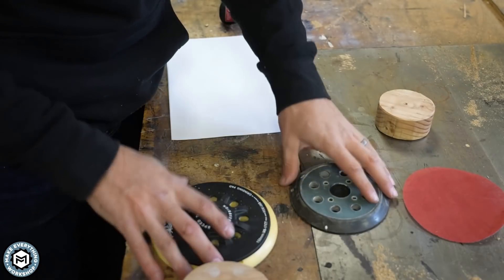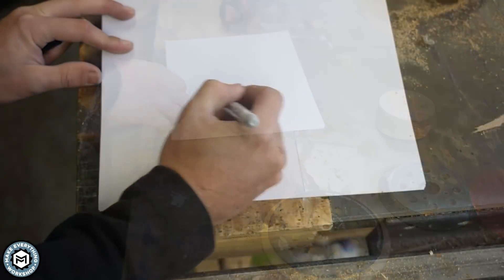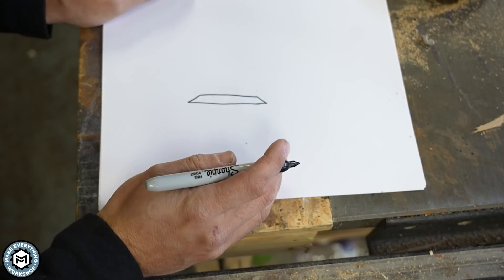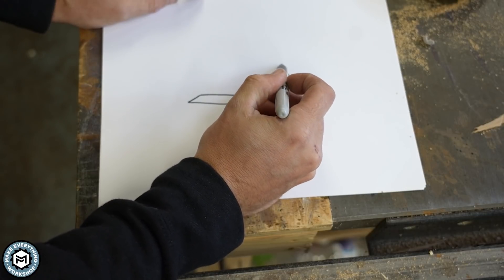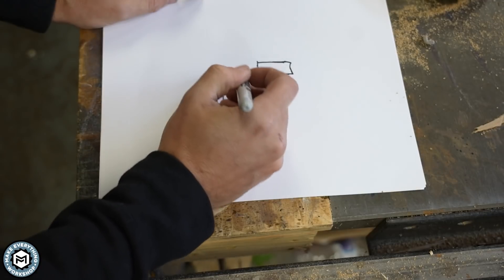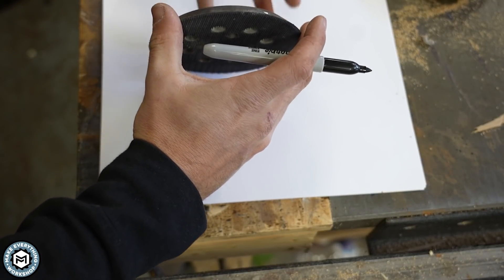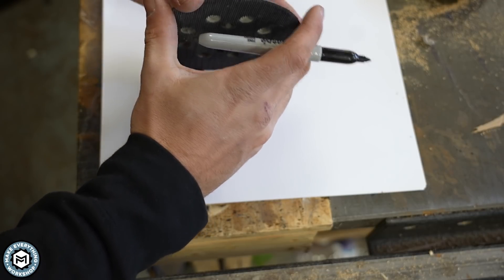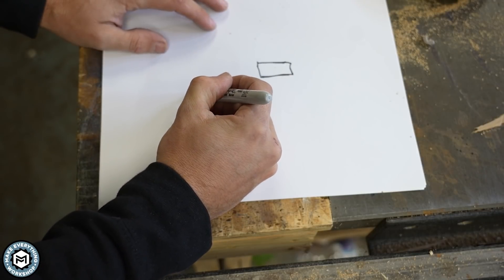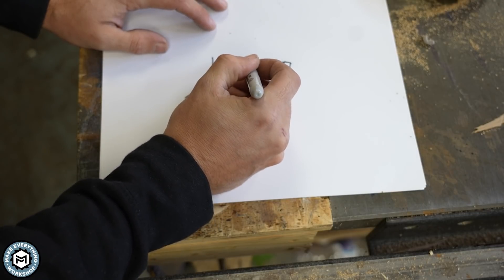The shape of these pads is very similar, and the design of a way to make it dustless was kind of the same for both. So if we take the general shape of one of these pads and think about how to make it dustless, I'd want some sort of a vacuum port to come in from the side, and then I need somewhere for the dust to make it up through the holes in the bottom and go into some sort of a chamber. My first thought was to use some sort of a plumbing fitting that would fit on top, but it wouldn't be ergonomic — really difficult to hold and use. So then I thought of this sort of bubble shape, coming up on the sides and then up into a cylinder, with a dust port coming in from the side.